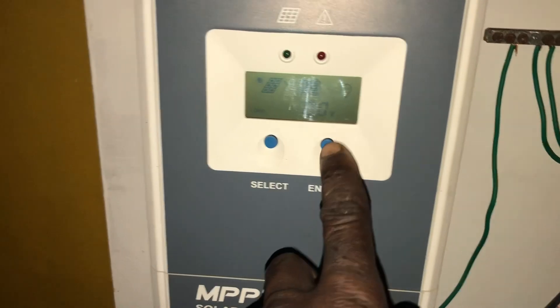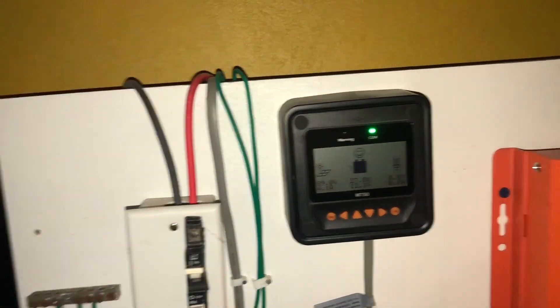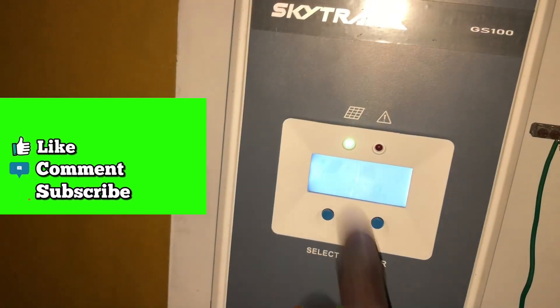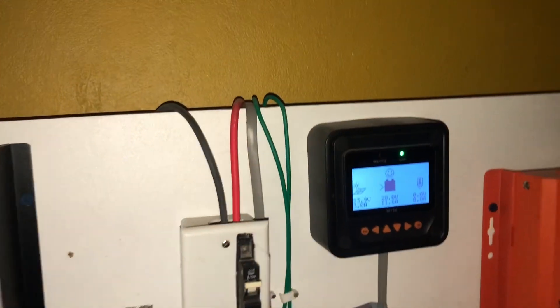The parameter control needs to be set, but as you can see it's charging now. We're using machines in the house — power tools and so forth — and all the regular house appliances, but somehow we just can't use the amount of energy that we see. At the moment, as you can see, my battery is full. Very shortly you will see where this green light stops blinking, which means the battery is fully charged and then the charge controller will cut off sending charge to the battery. And you'll see a sign come up: 'battery OVD' — that's overvolt disconnect.